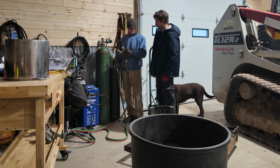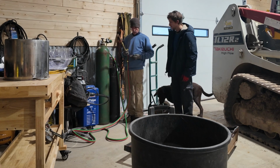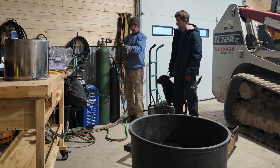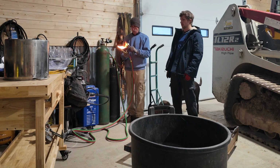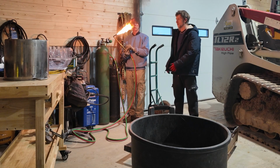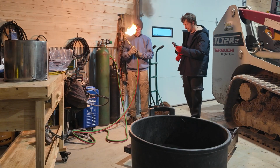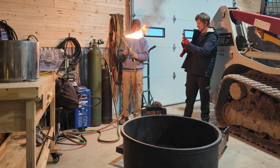Right? So all we do is we crack this a little bit here. Crack it. Give it a little spark. Get it going. Get it so that there's no smoke. Right there. Now we're going to introduce the oxygen. Watch the oxygen.